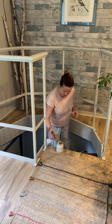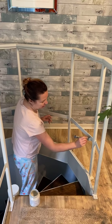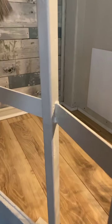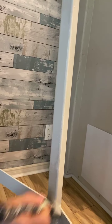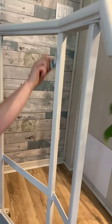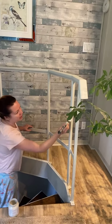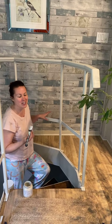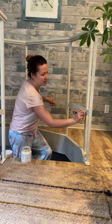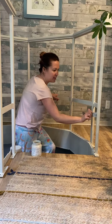I've got my brush and I'm just painting. So this has the first coat on it, and the first coat always looks kind of — it looks like hell. But you can already see the difference when you start putting the second coat on. Here's the first coat and then that's the second coat. You don't think it's going to cover on the second coat, but it does. This is a color that has really good coverage. I had somebody reach out to me yesterday because they were going crazy with their project and wanted to give up — they chose Casement as their first project, and it's just a tougher color coverage-wise, going dark to light. It has a higher amount of pigments, so it just takes a few more coats. But the majority of Fusion paint is usually done within two coats.